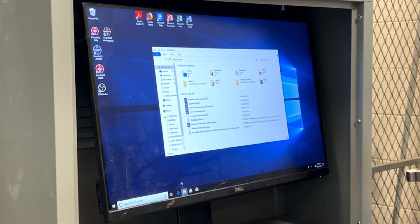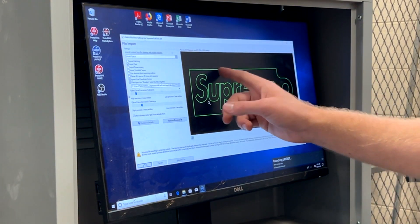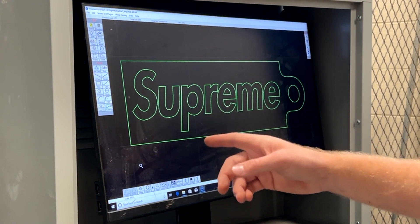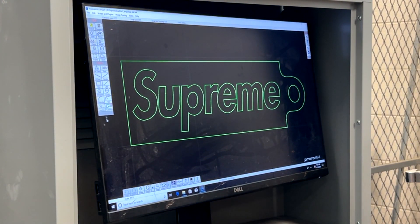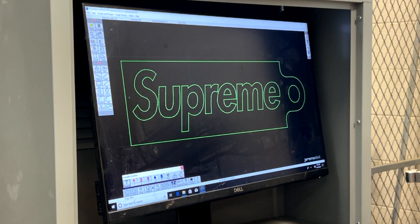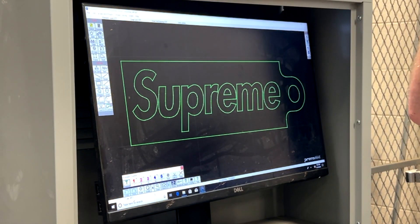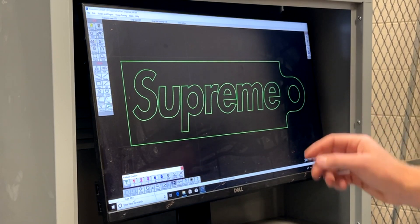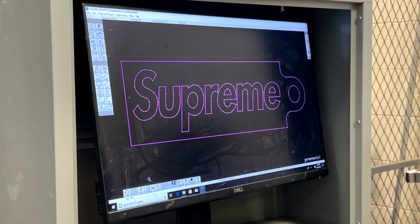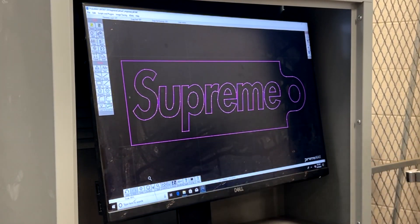Now that we have the flash drive plugged in, we're going to open up our file — Supreme Cut One. Press okay, and it'll be a blue file, which is how you know you're opening it in layout. Go to Edit, scroll to the bottom, and select Set Quality, All. With metal we might do three; with acrylics we'll do about one to two. Our metal is not terribly thick so we're going to do three. You can see the entire object has turned into the color for quality three.